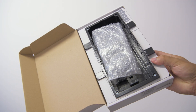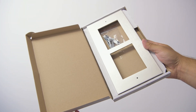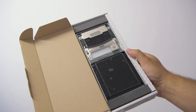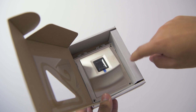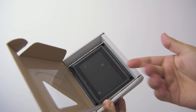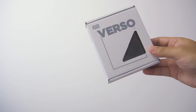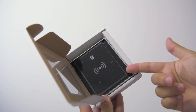We'll need two installation boxes, two flush mount frames, 2N IP Verso, a fingerprint module with fixing screws and cable in the side compartment, a display module with fixing screws and cables provided in the box behind the module, plus a Bluetooth and RFID reader, again with all fixings and cables in the box.